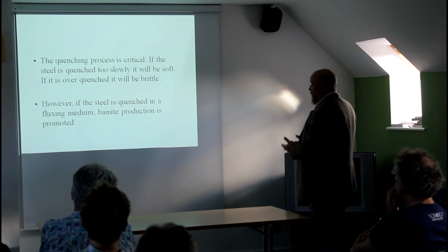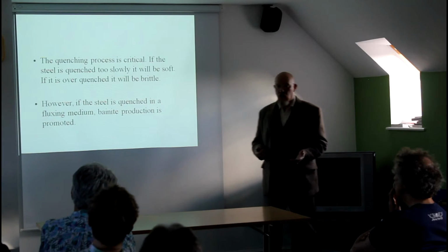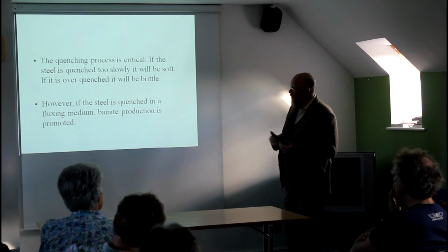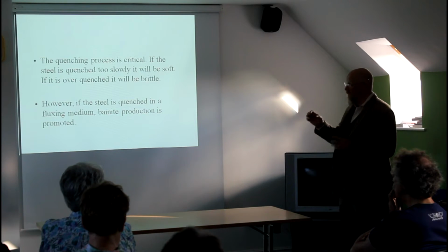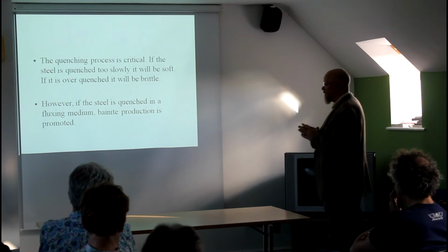So it's critical. If you do it too slowly, it's soft. Do it too quickly, it's brittle. However, if you get bainite, then you're onto a winner. And that's really what we're looking for. If you start to find bainite in Anglo-Saxon swords or Viking swords, you know you've got a phenomenal quality sword.